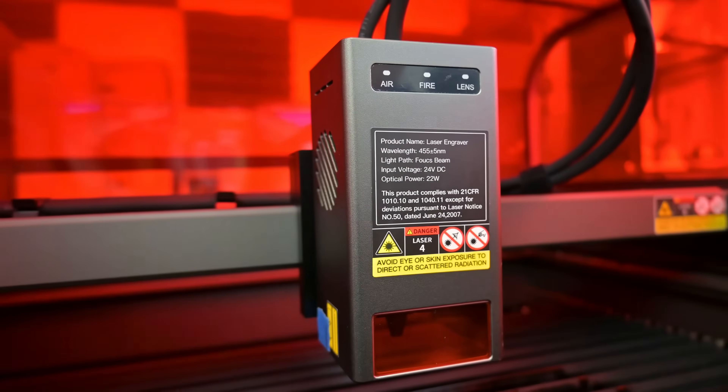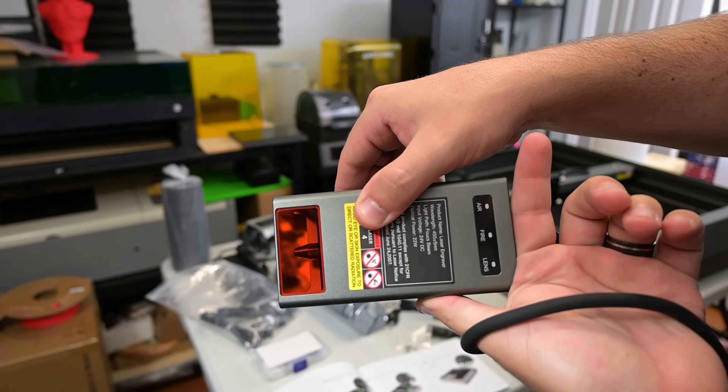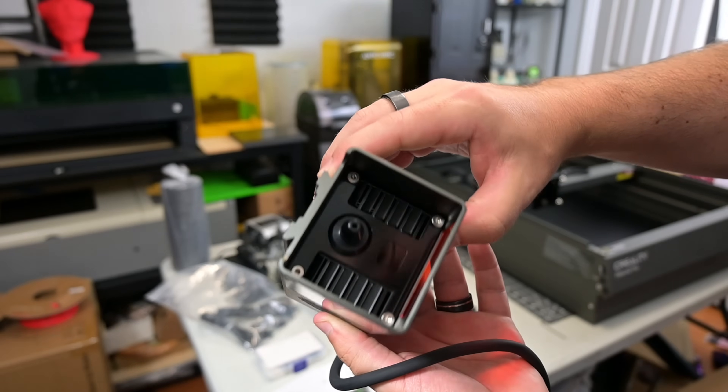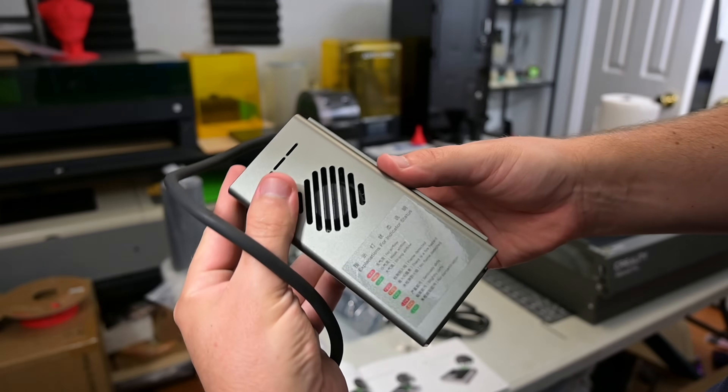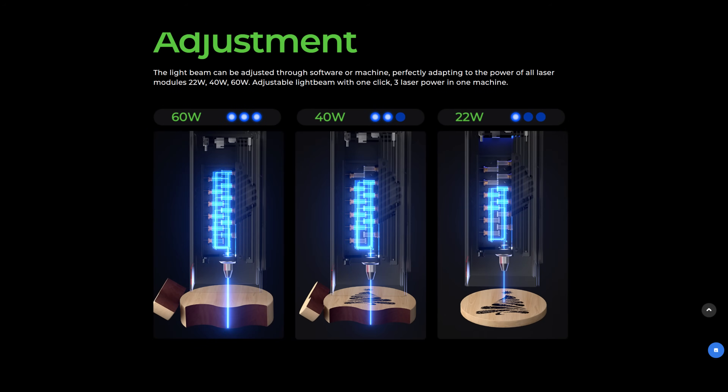I like that these alarms are prominently positioned directly on the laser module. As you go up in power, they pack more 6-watt diode laser sources inside the module. The 22-watt version has four 6-watt diodes, the 40-watt version has 8, and the 60-watt version has 10. As you combine more laser diodes, perfect alignment is harder to achieve, resulting in a slightly larger laser dot, which can decrease engraving quality — especially on images. To combat that, the 40-watt and 60-watt versions include a free 1.6-watt laser module you can swap out for extremely fine detailed engraving. The 60-watt version also has a trick: it's three lasers in one, letting you switch between 60-watt, 40-watt, and 22-watt modes via software — actually turning off some diodes rather than just adjusting power percentage — so you get all the advantages of a powerful laser without the drawbacks when you don't need the power.